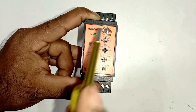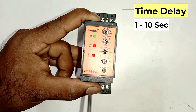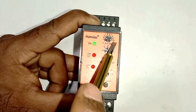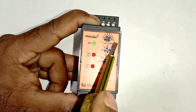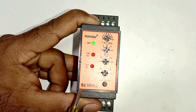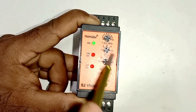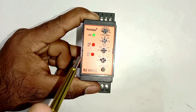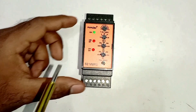After this, through this knob we can set time. It means when the relay operates, after how much time we want the circuit to break — this setting is done through this knob. The range is from 1 second to 10 seconds. If any tripping occurs, the relay will wait for this programmed time. If power supply gets normal within this time then the circuit will not break. But if the problem is not solved, when program time is completed the circuit will break.